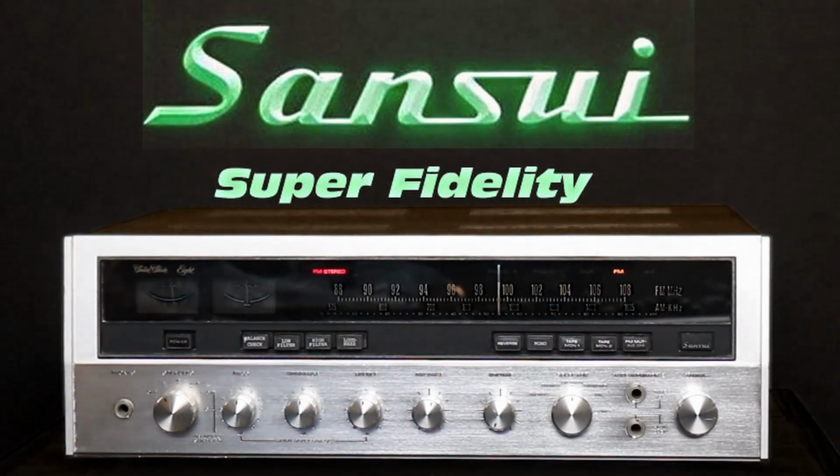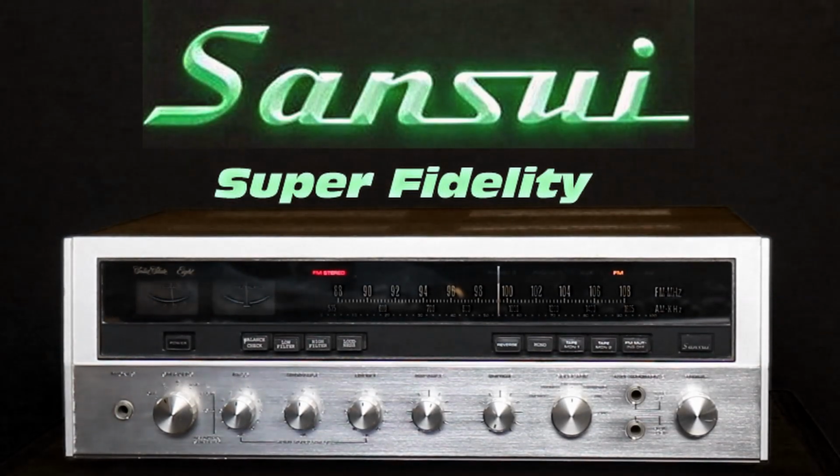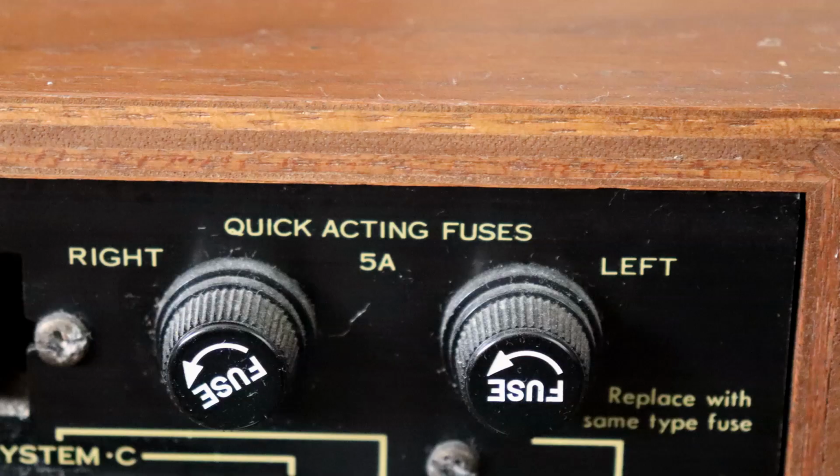My Sansui 8, the one you'll see in the video, is a non-relay model. There were 2 models. Mine does not have the speaker relay in it. What it uses instead are fuses from the speaker outputs, which is good. That's probably better than having a relay that you hope operates. Those quick-acting fuses should protect your speakers better if something happens.